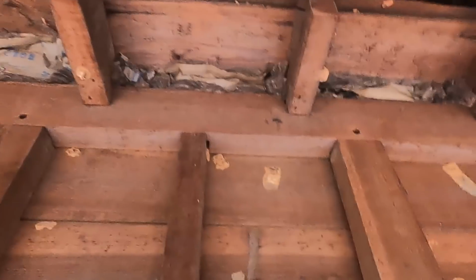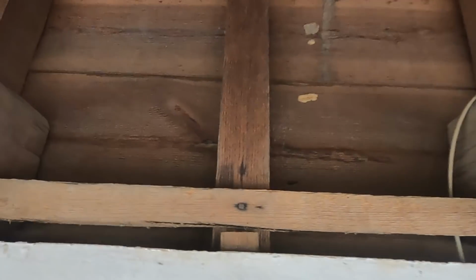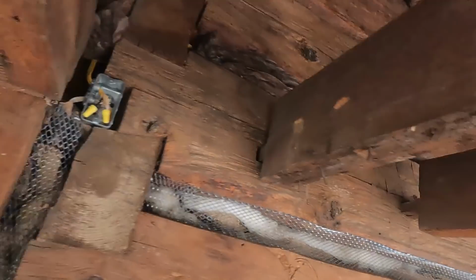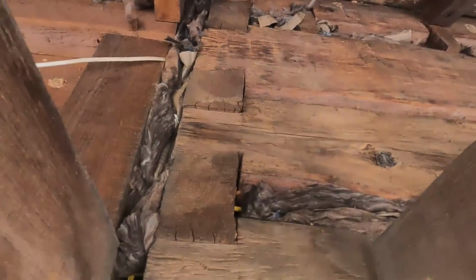So we have all our insulation put up here, and yeah, I showed a little extra. The paper is facing outward. It's just I folded it over. Now all of this is going to be getting insulated, and I ran out, so I'll be putting some more up over the next few days. But this is all getting covered with the board and batten, and then everything over here is going to be getting chinked hopefully here next week or so. But this should help with the draft.